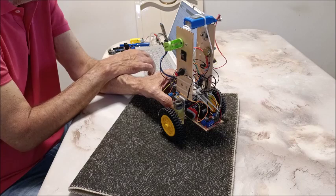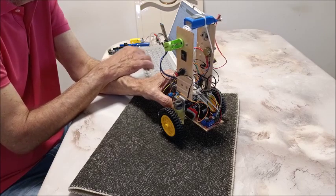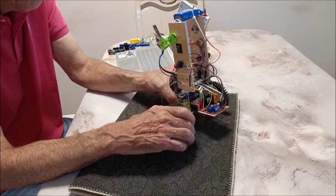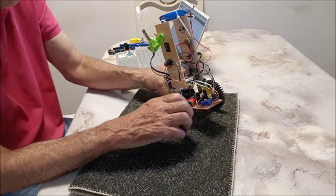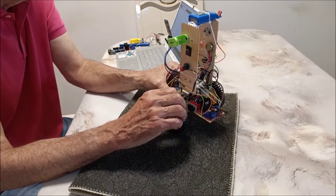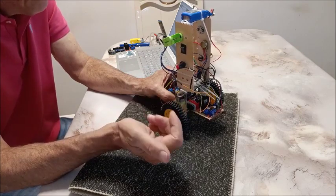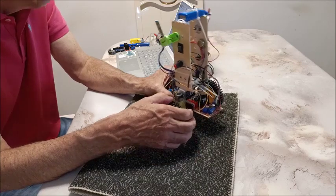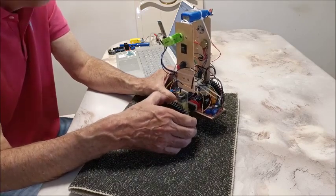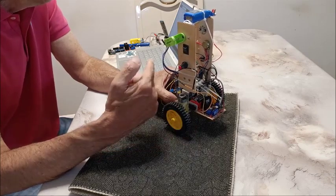When setting this up, be sure the wheels are turning in the direction of the lean — if it's leaning this way, the motors turn this way to catch it and tilt it back. In the program, do not use a low baud rate for the serial monitor because that will throw off the timing loop and the robot won't balance. Use 115200 baud rate; just changing the baud rate can mess up your program.